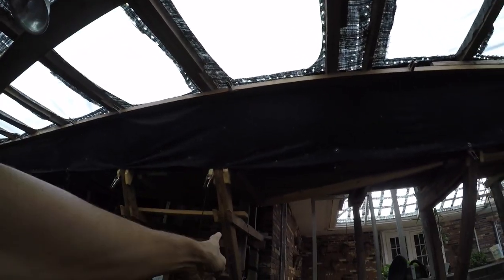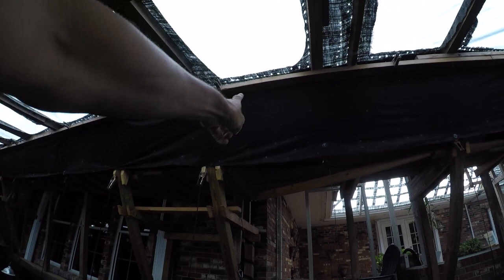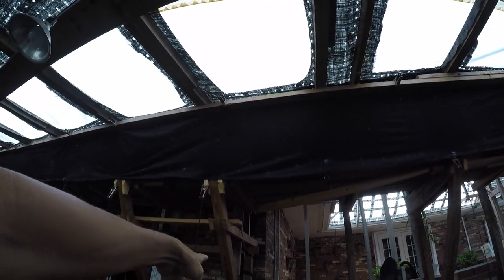There's also this odd member that used to serve a different purpose, but now it runs sort of at an angle. It doesn't matter. Okay, so this rafter continues on out of 3 2x4s. Then it runs again. There is an angular 4x4 and a straight up 4x4 under the overhang. So this doesn't go all the way up to the roof. Only this one does, the one at an angle.